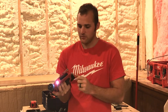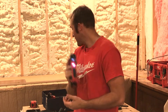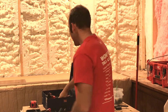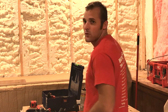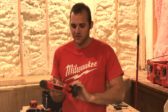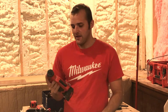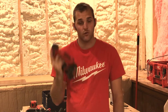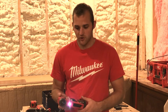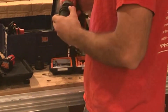The runtime was pretty good. I've got a 2.0 battery in here and power's pretty good. But if you put a 4.0 battery in it, I was actually able to run a bigger Forstner bit with a door jig — it's got a two and an eighth inch spur bit. This thing was able to turn it, but only on the 4.0 battery. The 2.0 battery kind of stalled out; the 4.0 battery powered through and cut through that solid door like no problem. However, with the 4.0 battery on, it doesn't really want to stand up if you have a head on it — it's kind of top heavy.